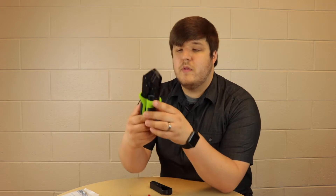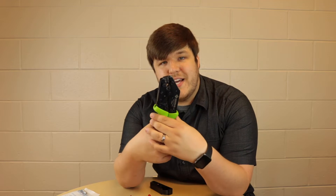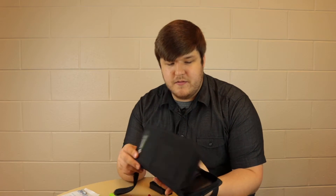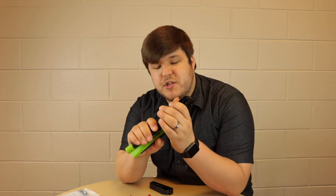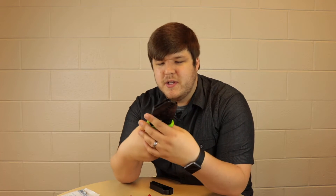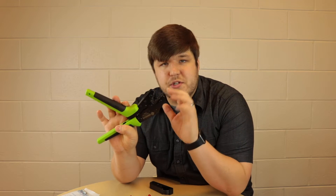Let's start with the crimper. What I've got here is a Greenlee PA-8000 crimp tool with the BNC crimp die set in it. This actually came with a whole set of dies and a little carrying pouch, which is handy. It also has a very ergonomic design — this handle is extremely comfortable even after multiple crimps, if you're doing a whole bunch of cables for a patch panel. You've got adjustable options to change how it ratchets, and thumb screws to easily swap out the die sets.